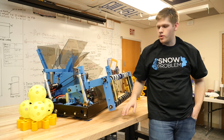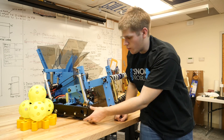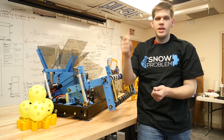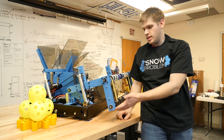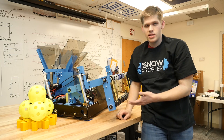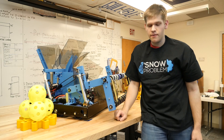Just to go over the powder coating — the result has a whole lot of blue, which you can see here, and some black on the frame. Basically, the powder coating is a coat that you spray on and then bake in the oven for about 20 minutes, and then it looks like this. It's really easy to get results like you see here. We've been cranking out all these parts — it just adds about 30 minutes or so to each part. Overall, we've loved the results we've been getting.